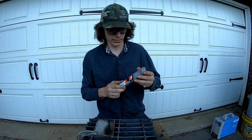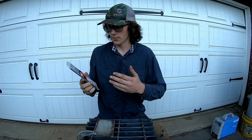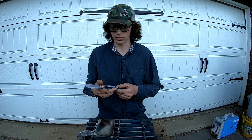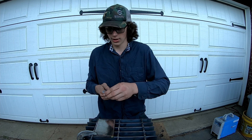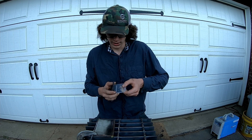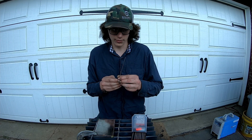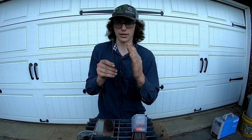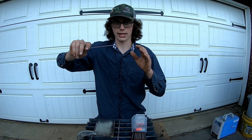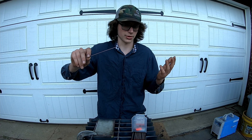The very first thing I'm going to be doing is sharpening my tungsten. This is 2% thoriated — I think that's how you say it — but it's the red tungsten. I was told this is going to be a good go-to for getting going, and I was recommended the 3/32nds size, which is the diameter of it. The information I've gathered is that I want to sharpen it vertically, because sharpening it horizontally can apparently cause a little bit of resistance to the flow of electricity. So we're going to see what we can do.